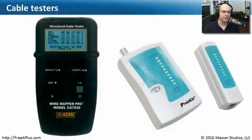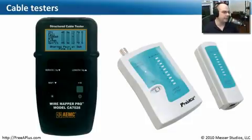If you work a lot with cables, especially network cables, you know that sometimes you're just kind of eyeballing things. You're looking at two ends of the cable to see if they match up. There's also some automated ways to do this. You've got cable testers that you can plug into a connection that will tell you more about what's going on. This happens to be a very detailed structured cable tester that will show you all the pinouts, how it's wired. It will tell you if two pairs are shorted together. It will tell you how far down the line those two pairs are shorted together. Pins 1 and 2 are shorted at 36 feet down the cable. So I can go 36 feet down, take a snip, put a new connector on the end of that and retest it and see if it really comes out and works better that time.